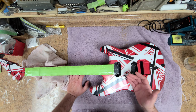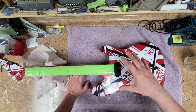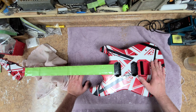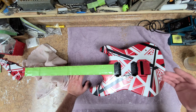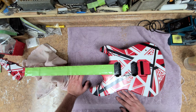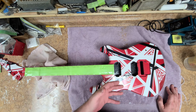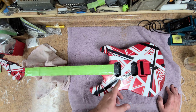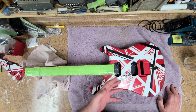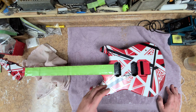The lacquer did exactly what I thought it was going to do — it checked all over that body. I don't want that when working on somebody else's guitar. Is it going to crack, is it going to chip? Polyurethane stuff is really really nice. We used to use it for painting cars. Plus I don't have to worry about it changing colors because nitro will end up yellowing in time. This 2K will not do that, and it's also water resistant and UV resistant as well.